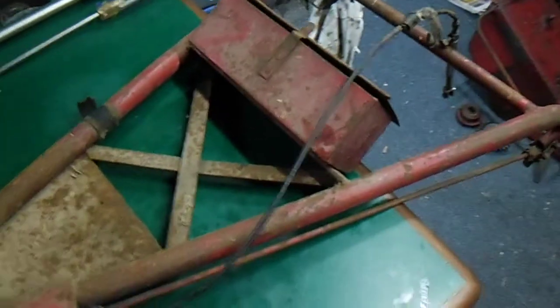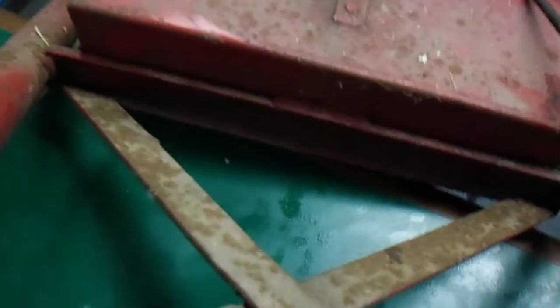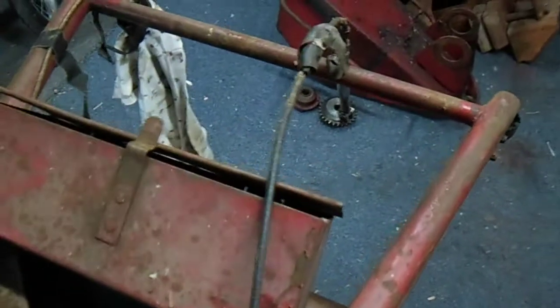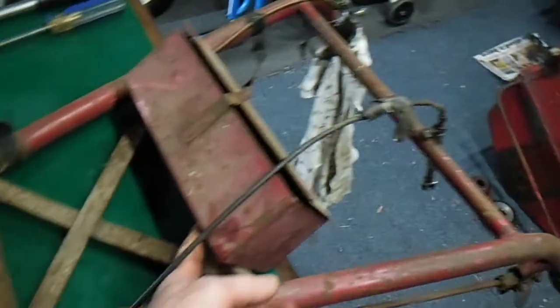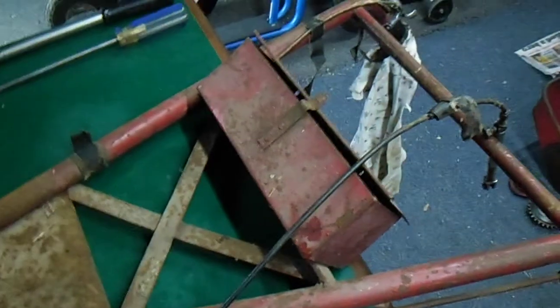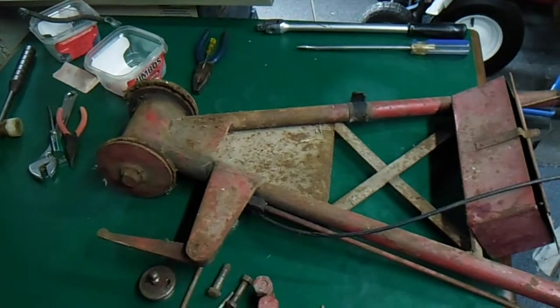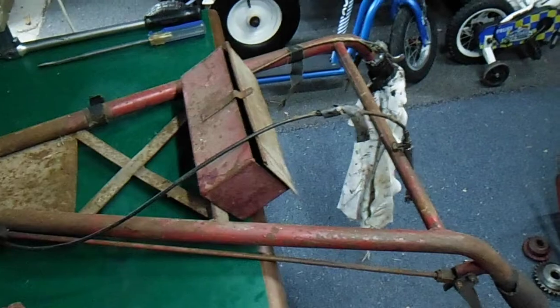I don't need the chain drive covers urgently until I get the chassis and everything obviously ready to connect to our nice shiny engine sitting over here. So I thought I'd just make a start on some things today. The little toolbox is probably the first thing I'm going to attach — it's actually welded on with a line of weld holding it. What I'm going to do is grind that free so I can work on the toolbox separately, then run some little nuts and bolts to hold it back on rather than welding it. That's going to make the tidy-up a bit easier.